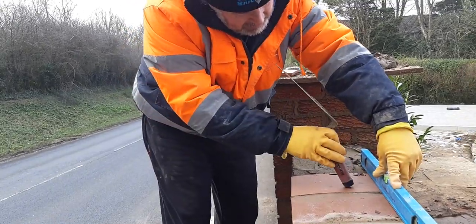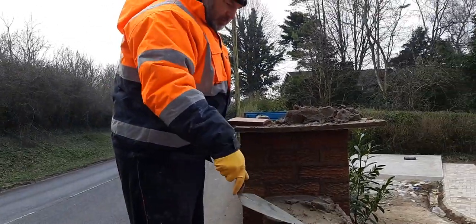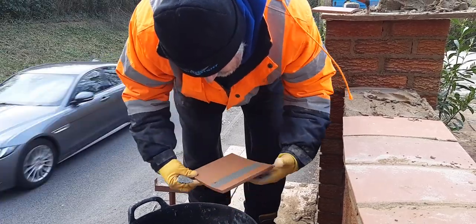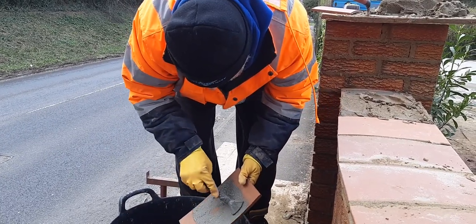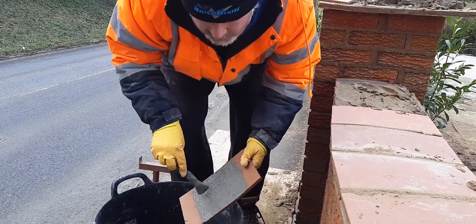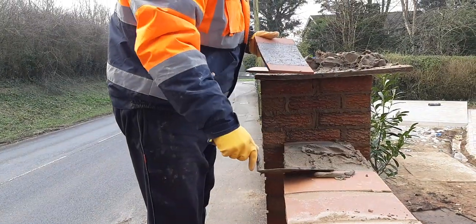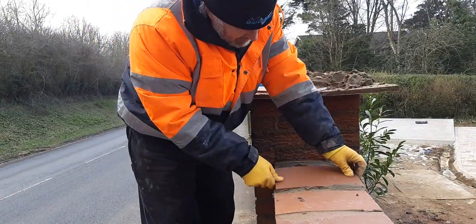Level off through, then a little bit more on there — same principle again. This slurry, like I said, we go back to the videos we use on paving — we use this slurry for any bricklayers out there that don't use it, we use it to go back to the porcelain to make it adhere. So we've kind of pinched that from what we do with paving to be able to use it on this, and I think it's a good idea myself.